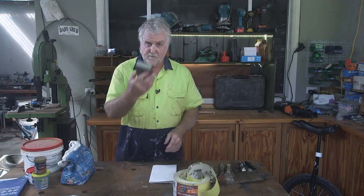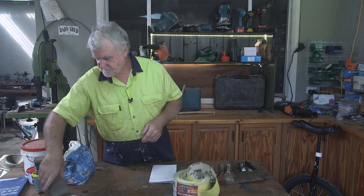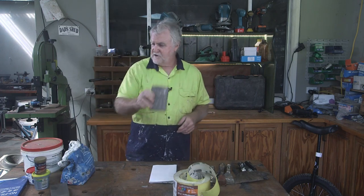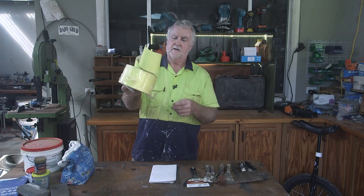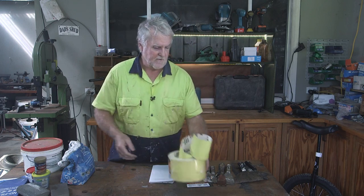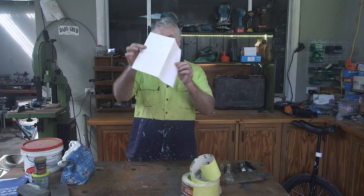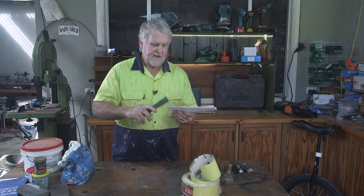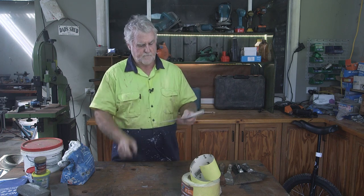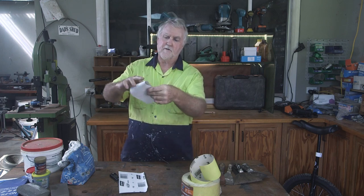Now with sandpaper — you can use blocks, I don't think they work that well. I usually buy sandpaper in rolls — 100-meter rolls or whatever. Some of you will buy sandpaper in A4 size. What you do is fold that in half, take your putty knife and cut it, and then with that piece you want to fold it in thirds.